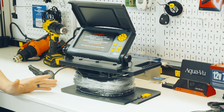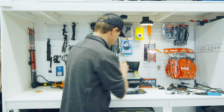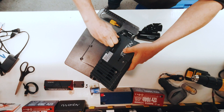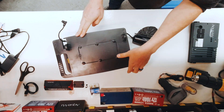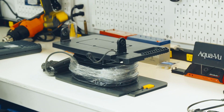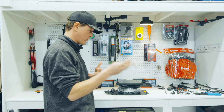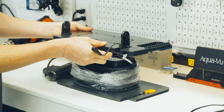I think this is probably around 75 feet of cable, but we're going to disassemble this thing and get into the guts of it. First thing, we're going to take this head unit off — there's just that one connector on the front, and this one connector does the power and the camera. We've got to pop off these six little rubber grommets. You can see inside — it takes a sort of Allen key. I took an Allen key, modified it, and turned it into a drill bit. I should note, I haven't done this modification before — I just had some ideas, been brainstorming. I watched another video — I'll link it below, very similar modification. We got the top plate off.